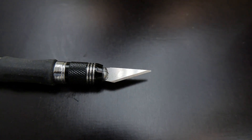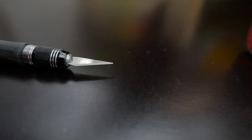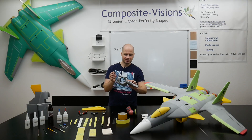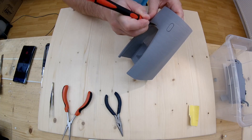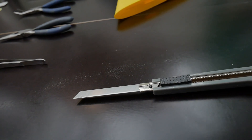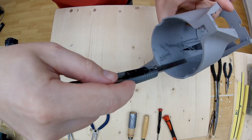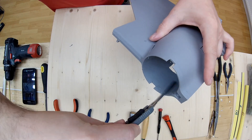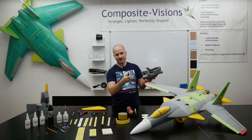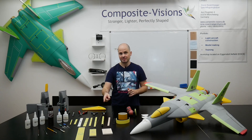That's why all your tools have to be safe — I especially rounded all the corners so there will be no injuries on the part itself. Next are these very sharp knives. These short ones are very important when you want to cut small parts, and especially this spike on the top helps in a lot of situations — for example when you want to remove the support in the magnet housing. Then I'm using this normal cutting knife with a very long and sharp blade, which I use on the outside to go along and easily remove the strings. For round surfaces it's really easy to work with and you don't have to grind the surface.